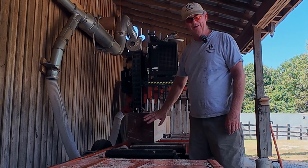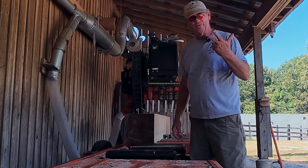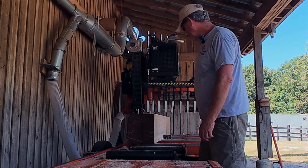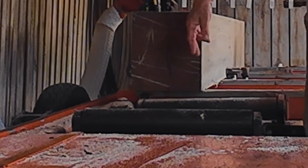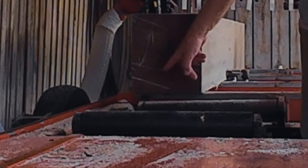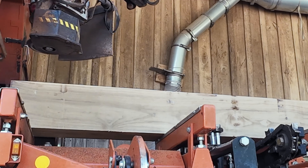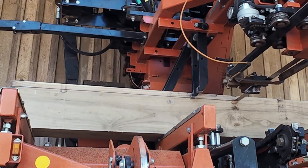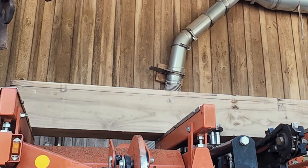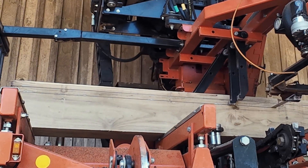At this point there's virtually no sapwood left. So now I don't have to worry about sapwood pull, and I don't have to worry about extractive shrinkage. What I have to worry about now is just the internal stress of this fully heartwood cant. I know I'm going to have stresses in this direction and this direction, but typically these stresses will be less. I'm going to take another one here, maybe one or two more, then I'll start working those. This one's laying pretty good. This one will be flat as a pancake.